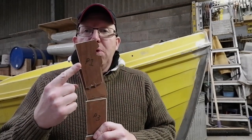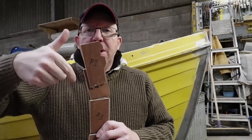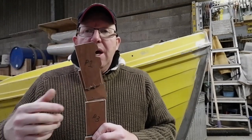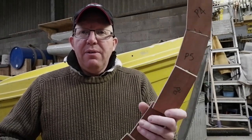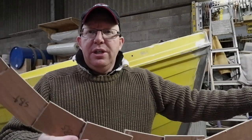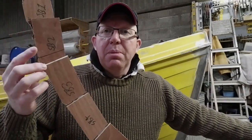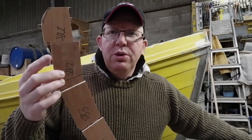What I had to do to get the pattern is make up some blocks of plywood — these are five millimeter by two and a half inches by five inches. Basically what we did is we glued them all together inside the vessel to follow the shape of the boat. And it does help if you number and tag them — that's starboard side two, starboard side one.